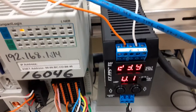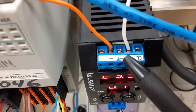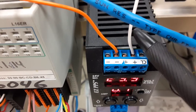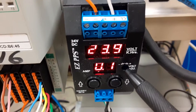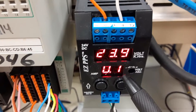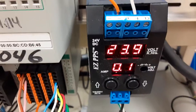Here's a video on your power supply connections for the controller. This 24-volt power supply on the right side has two positive connections and two negatives. We're coming out of a plus with this wire and minus with that wire. This is adjustable, so you could dial it up just a little bit to get 24.0. Notice the amperage is indicated right below that — right now it's taking about a tenth of an amp.